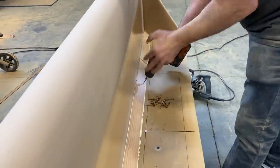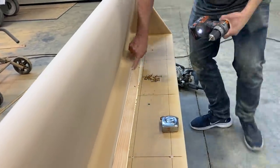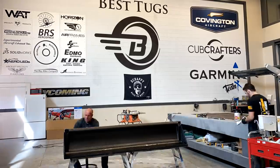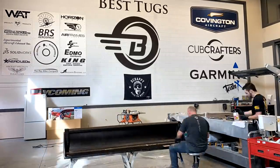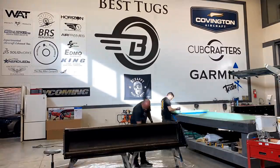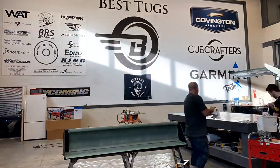It feels like it's been a lot longer day than it's really been. We started early this morning and it's only 7 o'clock at night, but once you start you have to just keep going until it's done. What I've got on here is just two layers of carbon fiber. I could have done fiberglass for sure, but I had a really heavy mat and a really thin layer, and the thickness I wanted — I didn't have enough of it. I certainly wasn't going to wait to save a couple hundred bucks, I didn't want to wait several days for the fiberglass. So we did it out of carbon fiber anyway. Tomorrow we'll sand it down a couple of different grits to a nice fine, polish it, then we can wax it and we'll pull the first part on it.